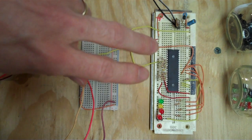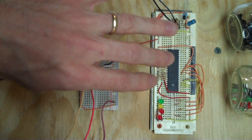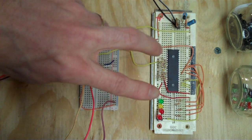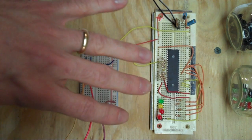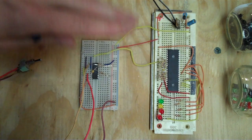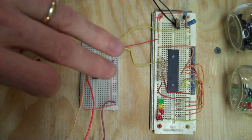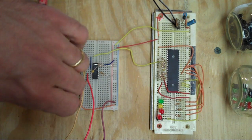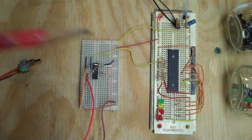its introduction in 1976. And when I say pretty much, the original version was clocked at 2.5 megahertz, and during its lifespan, they've managed to bring it up to 20 megahertz. So that's pretty much the only difference. This version here is a 10 megahertz version. They actually have a newer architecture, which is the EZ80, which runs anywhere from 33 to 50 megahertz, and is again, as far as I'm aware, software compatible with the Z80, which is pretty magic.